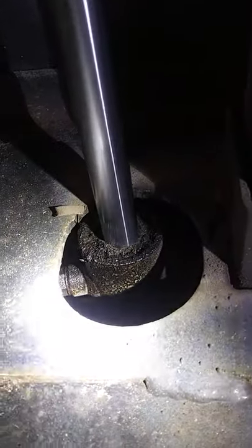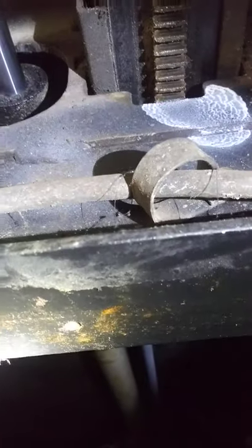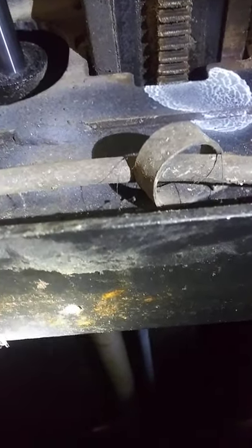I did find, unfortunately, that it looks like my cylinder has got a little bit of a drip. You can see on the end of the hydraulic ram here that it looks like it might be weeping a little bit. So I'm going to end up eventually having to pull that ram out and either have it rebuilt or replaced — that's several hundred dollars if I replace it.